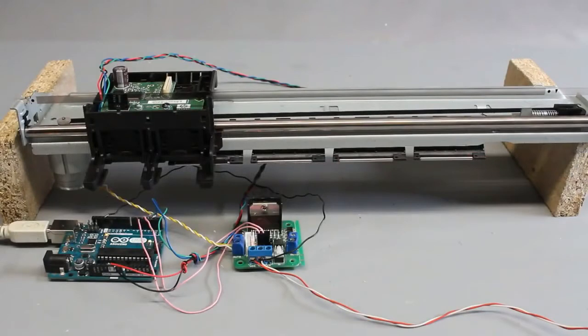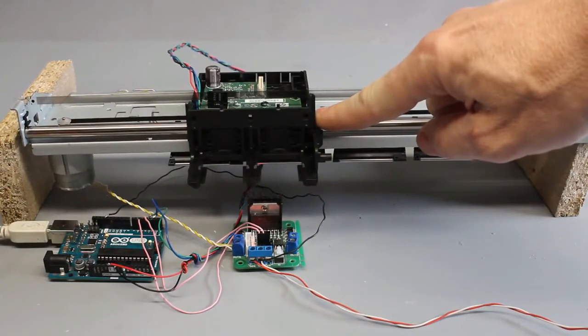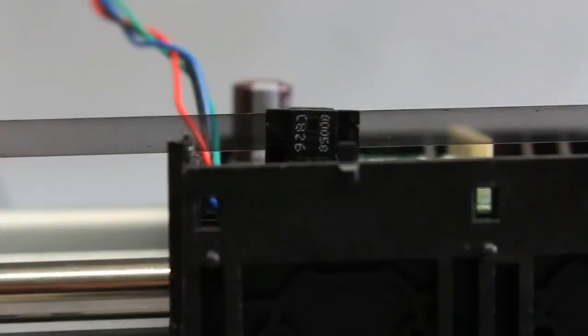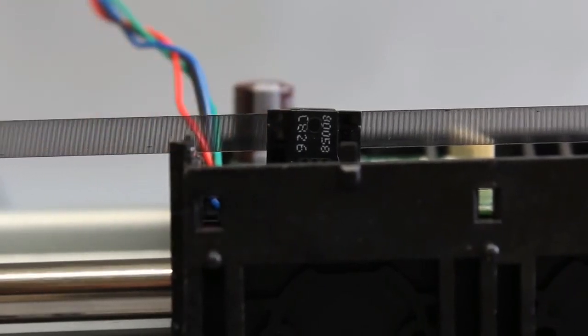With a linear sensor, the microcontroller can detect movement relative to the plastic stripe. If the carriage is stopped by hand, the motor is kept energized until the mechanism is released and the set point is reached. When deflecting the carriage manually, the microcontroller compensates the movement of the printhead caused by the side load. In doing so, backlash or slip are partially balanced by the control loop.